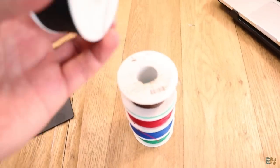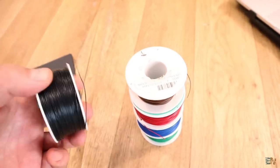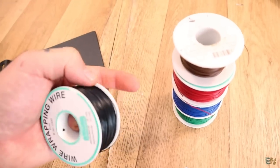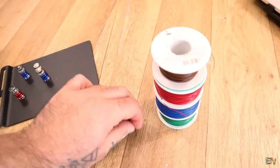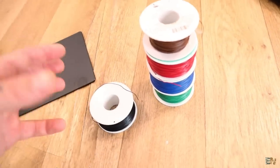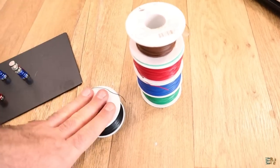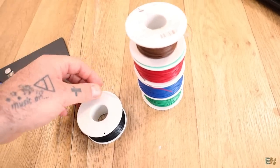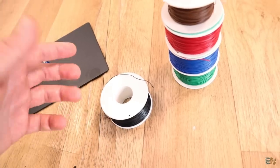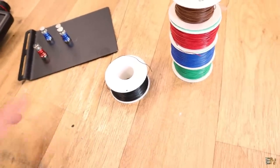As for the wires — many of you ask on my tutorials where I get these wires. This is actually not copper wire — it's called wrapping wire and it's made with some kind of alloy. It is good enough for short connections, but since it's not copper the resistance is quite high. On my escape room project I had problems using these wires for connections of 2 or 3 meters, because the longer the connection the higher the resistance and the larger the voltage drop.